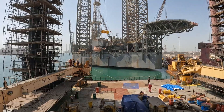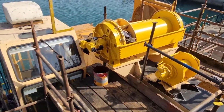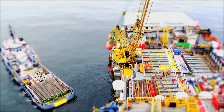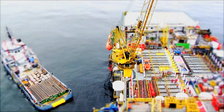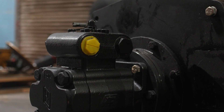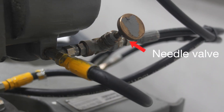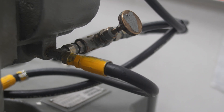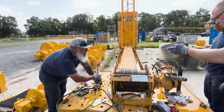In today's tech tip, we will be discussing how to properly and safely perform emergency load lowering for a hoist equipped with hydraulic motors. It should only be used on hoists equipped with gear-type hydraulic motors and the needle valve and fitting installed from the factory, which can utilize internal motor leakage to permit the load to slowly rotate the motor.